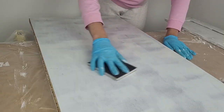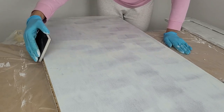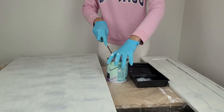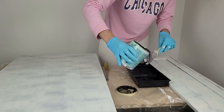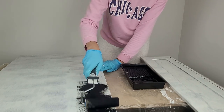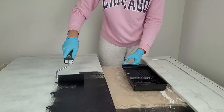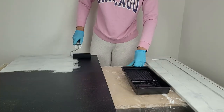To make the final paint stick even better, I lightly sand the primer using a 220-grit sanding pad, which is very fine. I clean off the dust and now the pieces are ready to be painted. For my paint I'm going with a black, water-based, quick-dry satin finish — the same paint I used in a previous video upcycling a rotten chest. I stir it well and pour it into my tray. I decided to use a better-quality roller; it's easier and quicker and doesn't leave lines like a brush does. The first coat is never perfect, especially on this primer, so don't be scared if the first layer looks like a mess. This paint is really good for furniture — you don't need to varnish over it and it's still stain and scratch resistant. I got nice coverage after two coats.